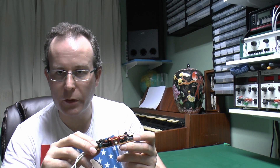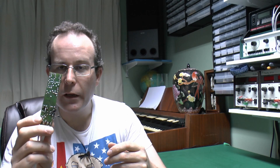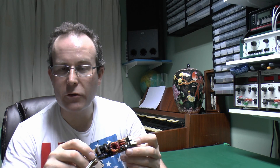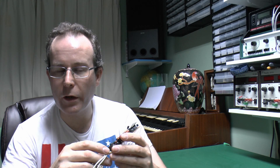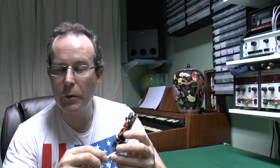It's fairly typical construction inside. These were very common until fairly recently — basically one of these per halogen downlighter, so if you've got 20 of those in the room, it's 20 of these in the ceiling. With the advent of LEDs, they're becoming less common now. Prior to these cheap switch mode units, if you had 20 downlighters you'd have a large, usually toroidal wire-wound transformer — extremely heavy and extremely expensive — and you'd have to run wiring from that to all 20 lights. That fell out of favour because the transformers were very expensive, very heavy, and had to be fitted separately from the lights. These can actually be fitted through the hole where the downlights go — a massive 10 kg toroidal transformer obviously can't fit through a hole in the ceiling.